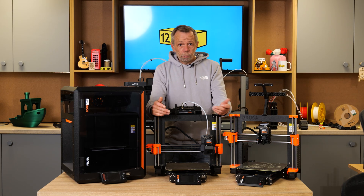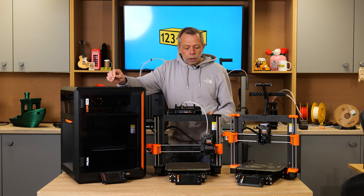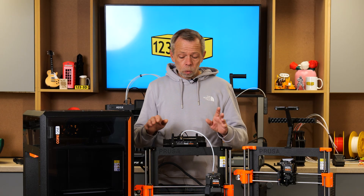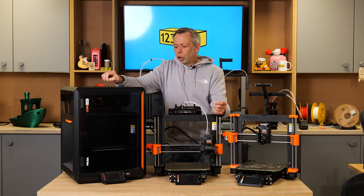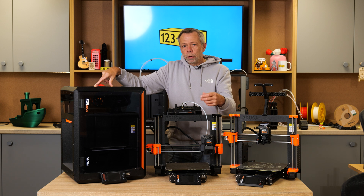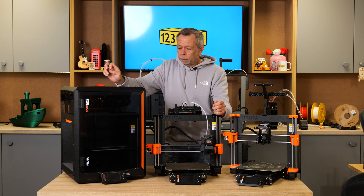If you want to keep it all in brand, you will go for the Prusa enclosure. But if you couple the price of the Prusa enclosure with the price of your Mark 4S, you are then above the price you would pay for a Core 1. So it makes perfect sense for £415 to buy the Core 1 upgrade kit, upgrade your Mark 4S to a Core 1 which then becomes fully enclosed. They've added features that make printing with exotic filaments easier — not active chamber heating, but it uses ambient temperature from the build plate and hot end to stabilise the chamber temperature via the exhaust fans. A thermistor in the back of the machine constantly monitors the chamber temperature, and once you've hit the ambient temperature for the material you're printing, the fans will exhaust any excess warm air to maintain that stable temperature, giving you beautiful prints every single time.